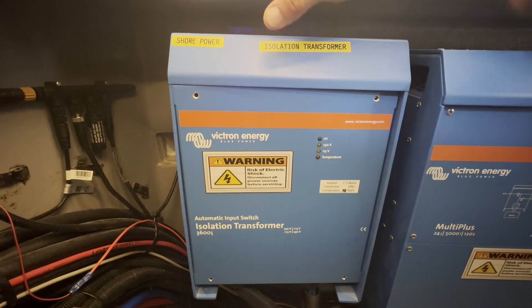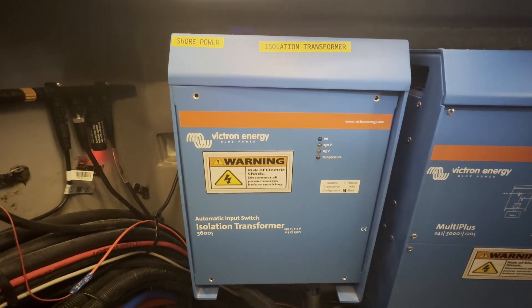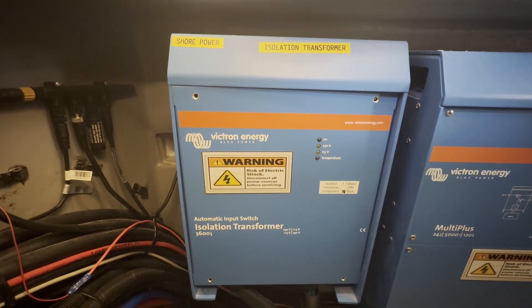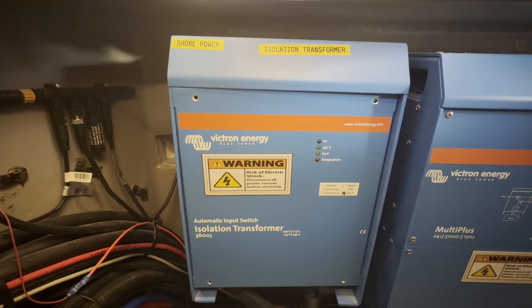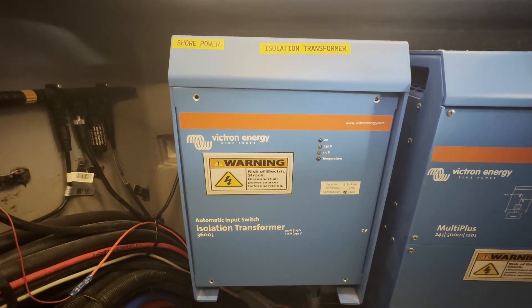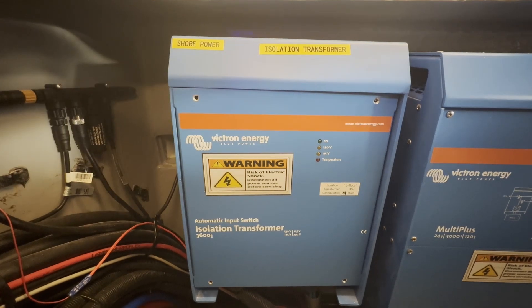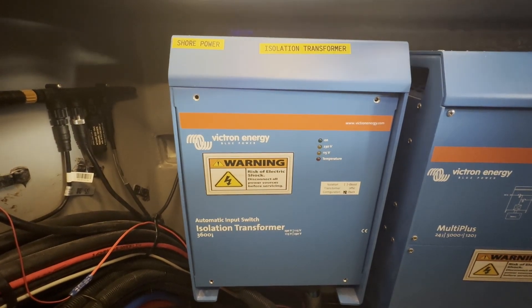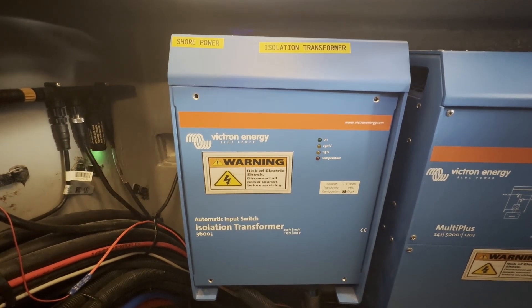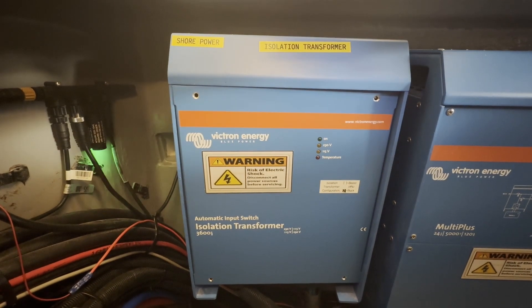However, Sue and I don't really hook up to a dock very often. We have a little 2,000-watt generator that puts out voltage right on the back of the boat, so there's no drop. When there's no load on it and you first connect it, the voltage is 127 volts. By the time that gets doubled and then four percent is added, it gets to be way too high — almost 260 volts. That voltage is enough that the multi-plus charger-inverter says no, that voltage is too high, I'm not going to pass it through.